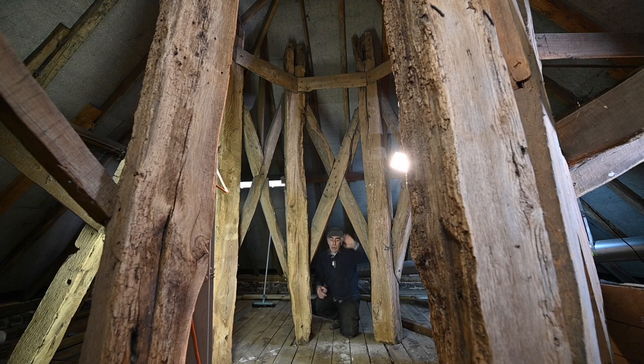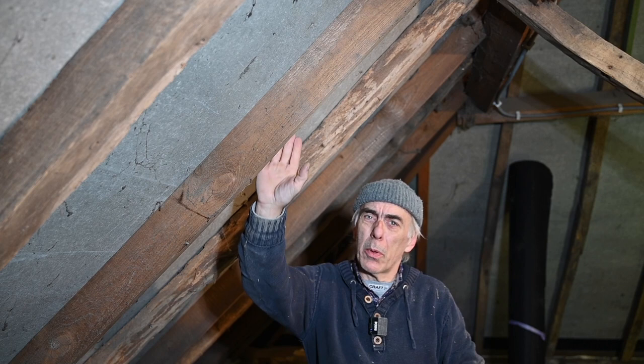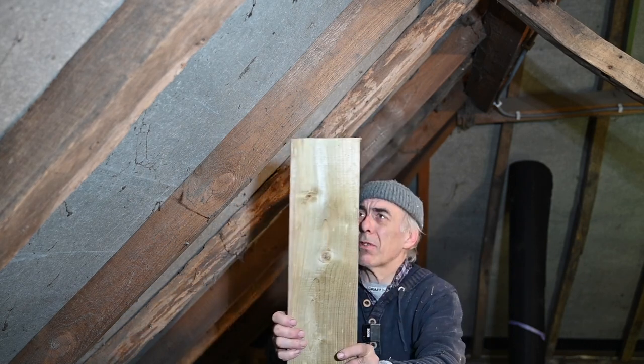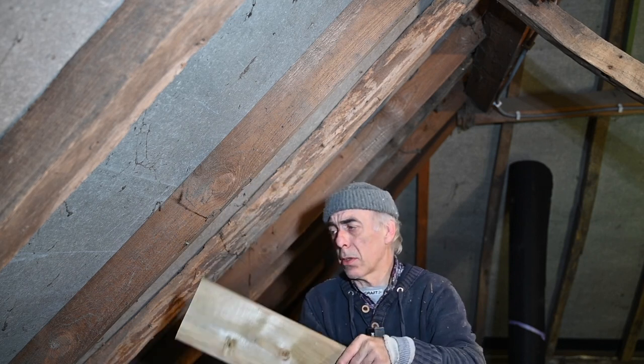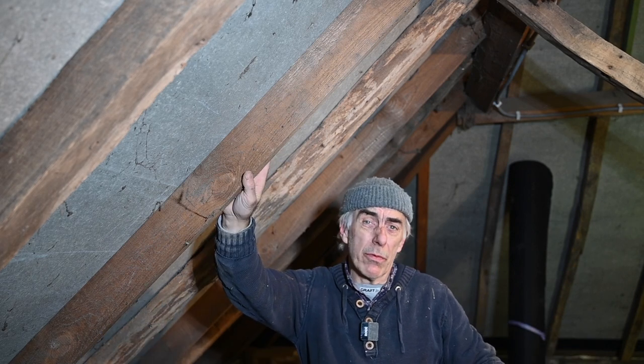Initially I was planning to remove it, but finally I decided — why should I? It's part of the history and the ceiling is more than strong enough. What I'm planning to do is to support these rafters with a vertical rafter, so we have a very strong support, and then connect another horizontal rafter. That will make a nice triangle and make that roof so much stronger.